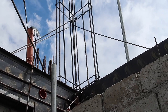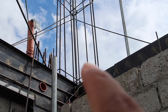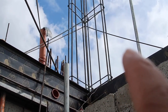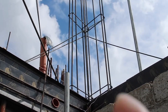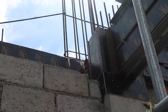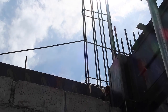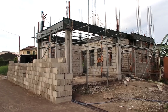You can see right there they put — one, two, three, four, five, six, seven, eight, nine, ten, eleven — so there are eleven bars: maybe 10 of the 16mm and one of the 12mm. I don't know if they're going to add more on that column, because this one we have eight total. They're going to suspend that one, and maybe they will still add a 12mm on the side of this column.